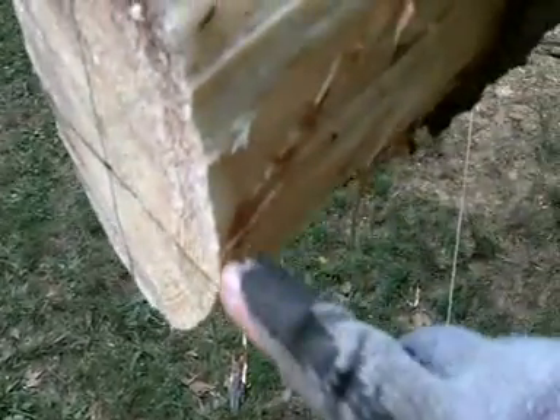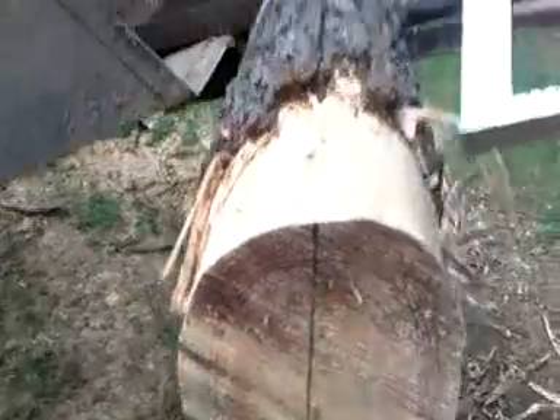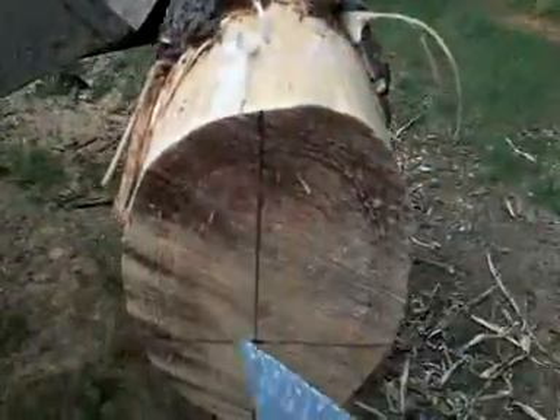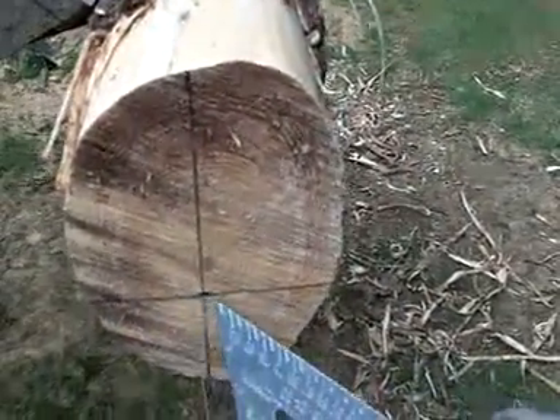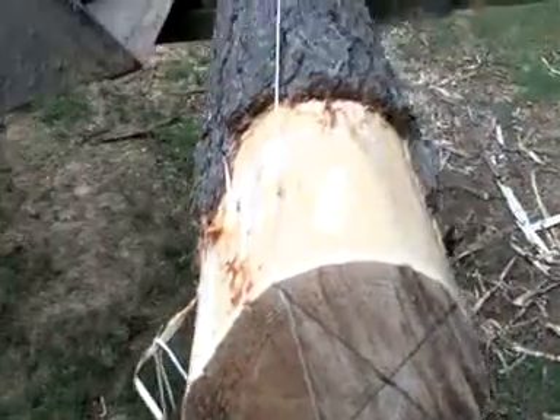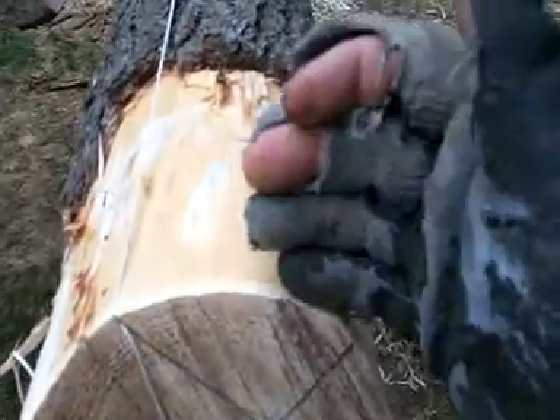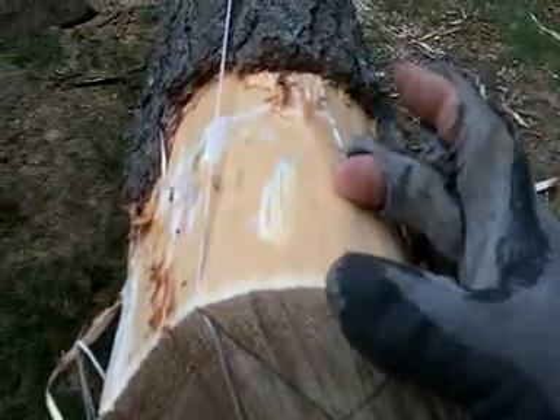Then what we'll do — I know how far I have to come in — I'll come in and measure it and mark it, and I'll take a chainsaw and cut it out. But if you mark this five inches here and go down on the other end and mark it five inches and come across, this right here will equal the other end out and be level. After you've marked it, the next thing you want to do is peel some of the bark off. This end is only going to set on half the width of the post, and that end out there — peel back more — because it's going to set on the post and I'm going to have a bigger overhang on it. When I square the roof, it will be trimmed off.